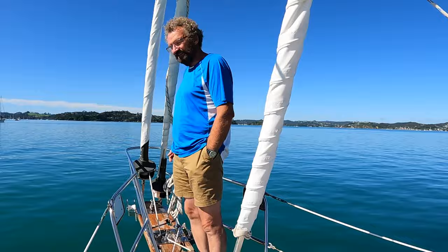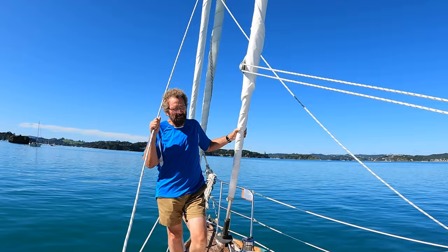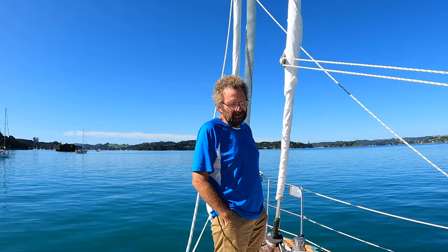And your staysail is, I don't know how the staysail is percentaged, but it basically goes almost to the mast. And it's self-tacking. Those features are really nice because everything's fed to the cockpit. So we can totally run the staysail. We can reef it, we can furl it, we can do the outhaul and the sheet and the topping lift, everything from the cockpit. That's amazing. So that's really nice for shorthanded sailing.